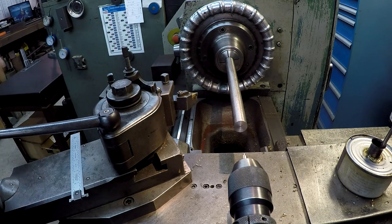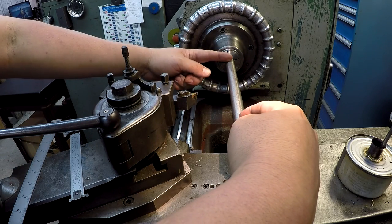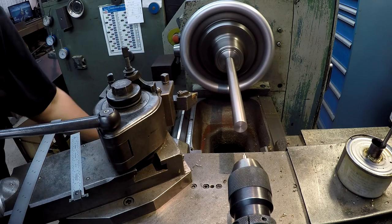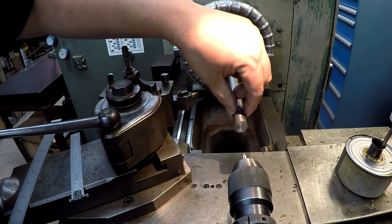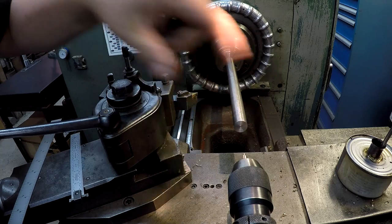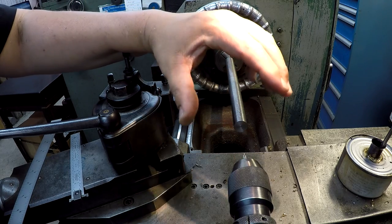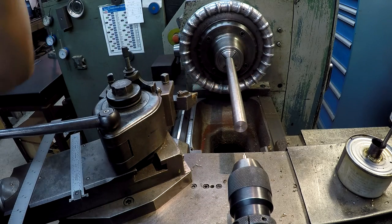So I pulled it out about 9.5 inches. We're going to have a total workpiece of 8 7/8. So we've got about 5/8 there. All right, you see how that's whipping? If I was to center drill that up here and then extend that out and center drill it, or the center already be in there, then that's going to be a center that's running out. And you can shove a center point in there and make it run center, but then it's not exactly running true like it should be. So right now it's in its natural state where it wants to run.